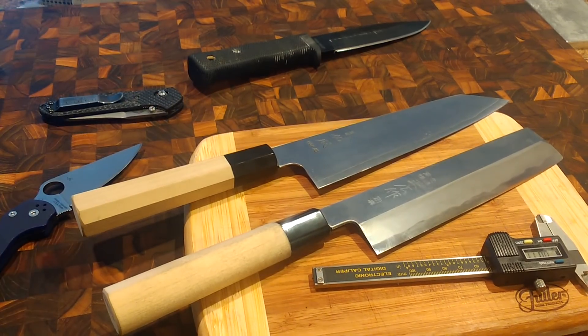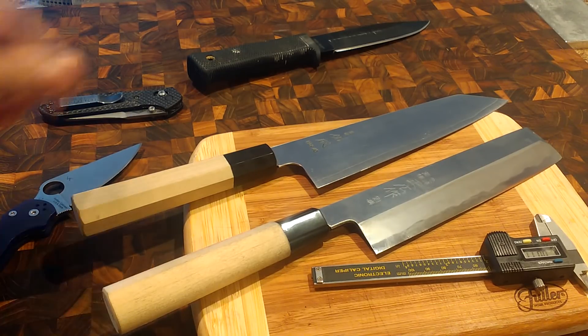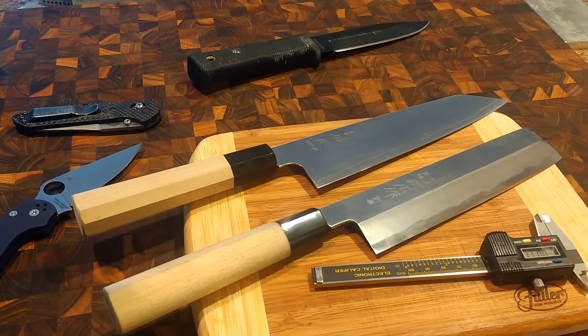So really, geometry is the real hidden reason why your knife is either performing amazing or not. But all that stuff is related. You can't have a thin geometry on a knife if you don't have a good heat treatment on that blade. There are certain steels that can basically be tougher at higher hardnesses than cheaper steels, so you can have more capabilities for thinner edge knives with steels that can take higher hardnesses but still maintain some of that stability.